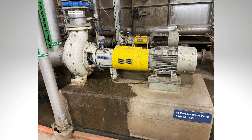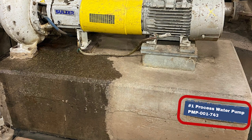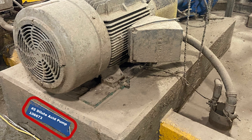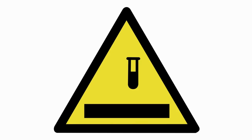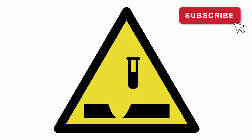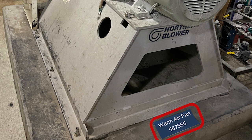For our first example, let's look at labeling and numbering on pumps, fans, and similar rotating equipment. Since individual components will be removed and replaced, label the foundation or the base plate. Stenciling the equipment number and name with a bright paint works well in many applications. Some rotating equipment is in contact with corrosive fluids, so you'll generally have to inspect the labeling on rotating equipment trains more often than other types. Also keep in mind that the piping and valves around rotating equipment are often a spot where operators and maintenance are working, and they make good candidates for clear labeling.